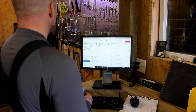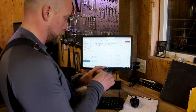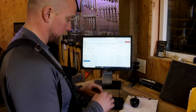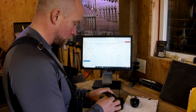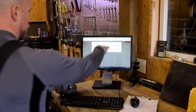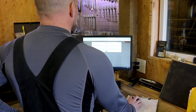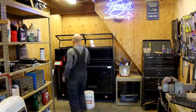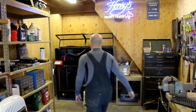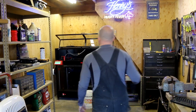I have to go back and forth to the printer. It's homing right now. I think the 0.4mm nozzle got jammed — smaller nozzles are more prone to jamming. The printer is telling me it's ready. Now I've got to control it all from here. The thing that happened last time is that these offsets are slightly different and you don't want to crash the nozzle into the bed.